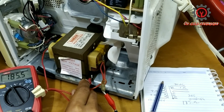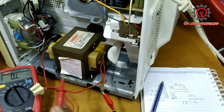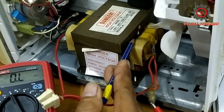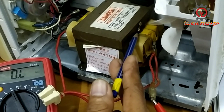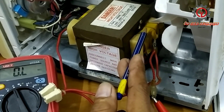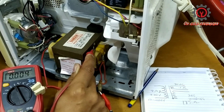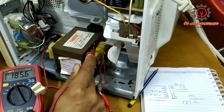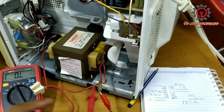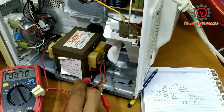Don't be confused, guys, about why the secondary winding appears shorted — it's because one end is welded to the E-core. When you test it you get 185 ohms. Take note: it is NOT shorted. Don't declare it shorted — it's ground. Same reading: 185 ohms.